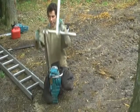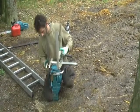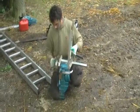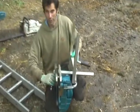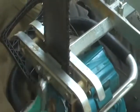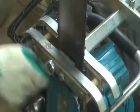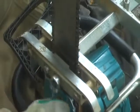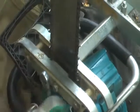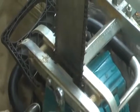This is a small log mill — that's what you get. It just slides down onto the bar, and you can come round here Toby. I want you to film this doing up the nuts on it. Just tighten up these nuts — they actually bite into the bar, and that's what actually grips it, keeps it solid. I usually just keep going from one to the other, just get them on there nice and tight.